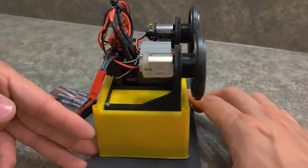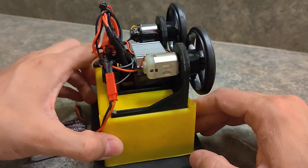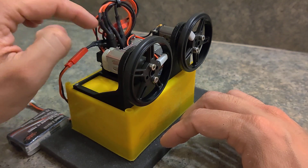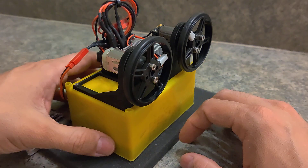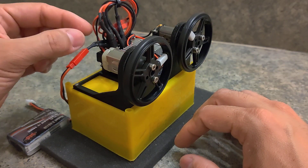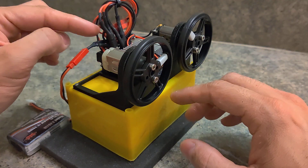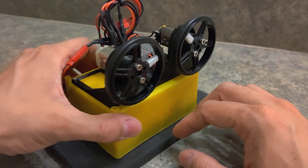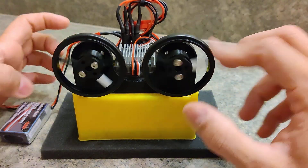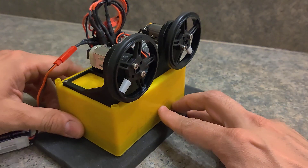The test bench is very simple. I used a dual motor ESC out of a 1/10 scale crawler and hooked each motor up to one of the motor leads. If you look at the ESC on the inside, there may be two leads coming out but they're actually coming from the same source, so they're not separate signals — it's straight up power going to both of them. Because of the difference in turns, you'll see different RPMs on these motors.